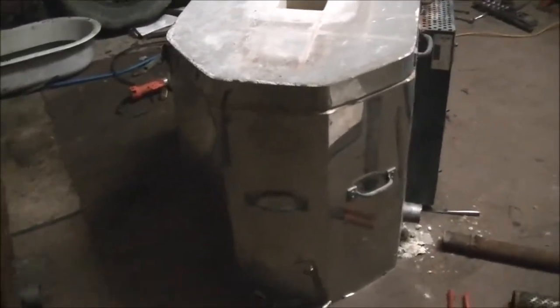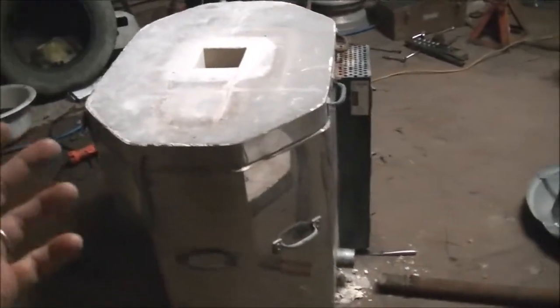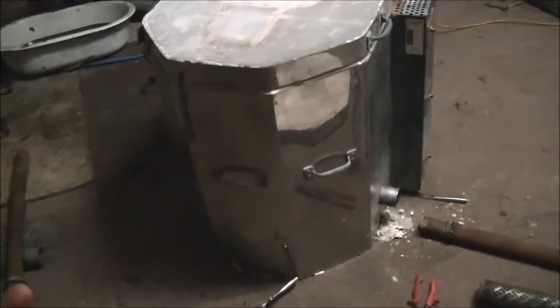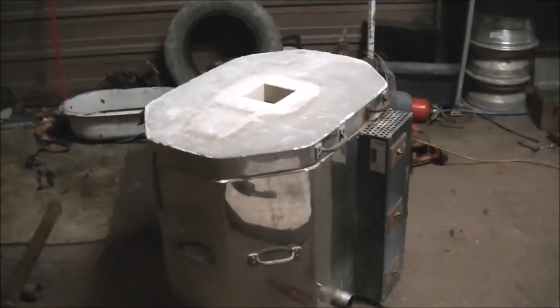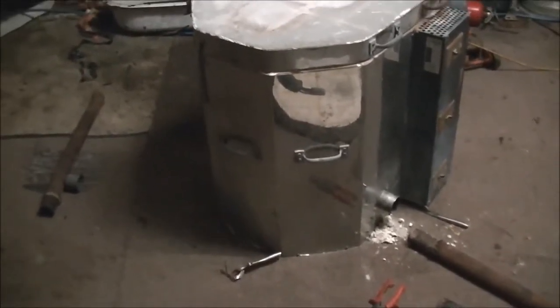I figured: furnace at the landfill, use that to process the metal — you've seen that run; I'll probably put a link in the description. You just drop whole engine blocks and raw materials in there, it melts everything through the bottom except for the stuff that melts at higher temperatures like steel and screws. It'll melt the copper off the coils on a lawnmower engine — you got to watch that — but it's pretty easy to separate molten copper from molten aluminum. The crap stays behind, the good stuff falls into a bowl of water and I make it into pellets. After that I put the pellets in a crucible, clean all the crap off, get it good and pure, and then make bars like that right there.